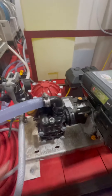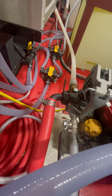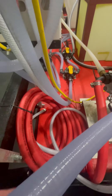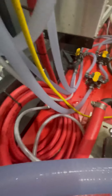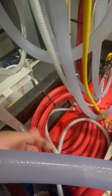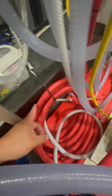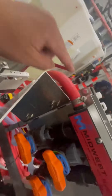Whenever I let off the trigger it's got a bypass — a 25-foot bypass hose that just circulates. Make sure you prime that: whenever you're priming it, let go of the trigger, let water flow through that bypass line. Sometimes if your bypass line is empty you're not really priming — you got a bunch of air in that hose. So throttle this open and close to get some of that water through that bypass line. As it goes in through the bypass line it comes back this direction into this whole loop.